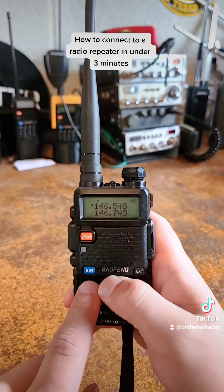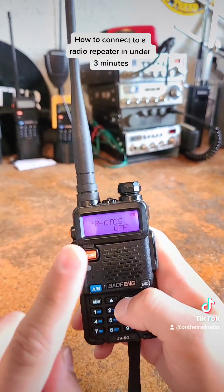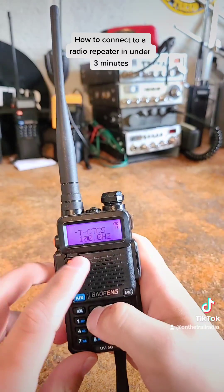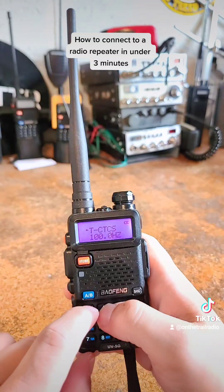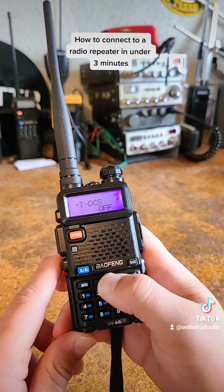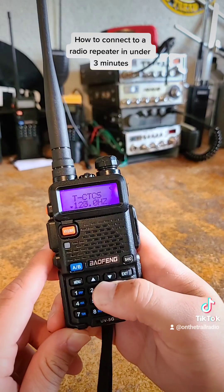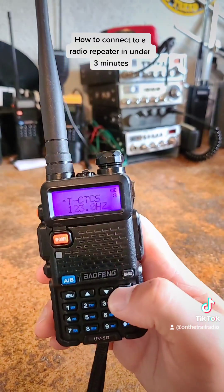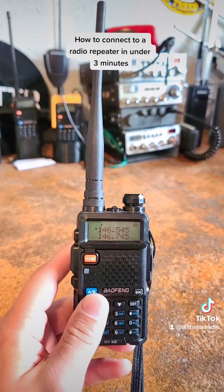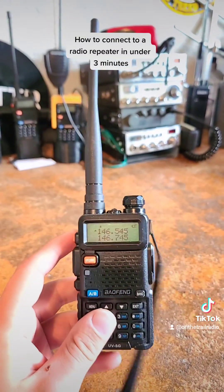Something you're going to want to remember to also access these repeaters is the receive and transmit tone. The receive tone is not as important — if you just leave it open you can still hear it. But make sure that you have a transmit tone that actually works with it. Usually in amateur repeaters the transmit tone is generally 123 Hz, which is the most consistent tone. You could always look it up online if they have a different tone. GMRS is more prone to having multiple tones since it's a little more accessible.